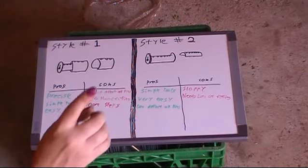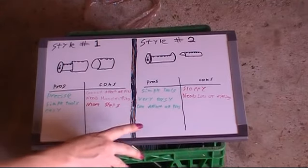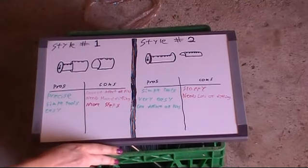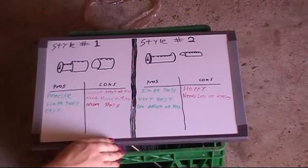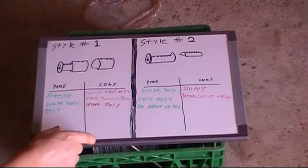Anyway, yeah. This is how I did the lock I sent to Art of Klein. This is completely different. You don't even need to use the power drill for this. What you do is you just file a flat across the top of your core, and then you cut a semicircle cross section out of your piece of tubing that fits in the flat slot you cut.